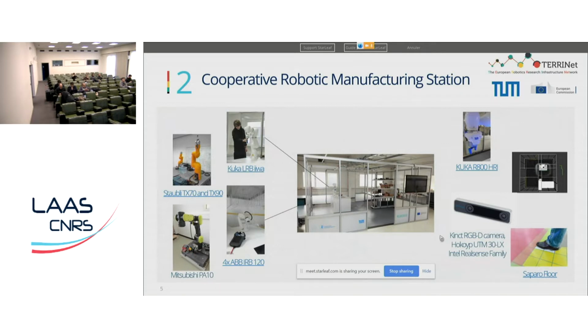And we have a full simulation of the robot arm in Gazebo, and the laser scanner works well with Gazebo too. As I told you before, our preferred option is ROS, and it can also work with MATLAB, and it's also possible to control with the KUKA Fast Research Interface. It's also fully integrated with MoveIt, and Kinect might be used with PCL or OpenCV.